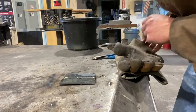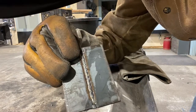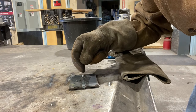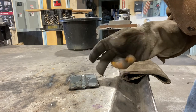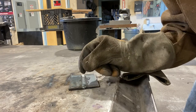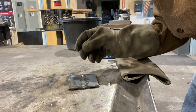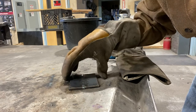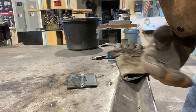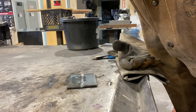All right, when all is said and done, you're going to find a pretty flat-looking weld, but also you're noticing the penetration that's on the other side of that weld. What you're looking to do is create a nice consistent spacing — keep inching further and further. Something you could definitely notice with my weld here: maybe I went a little bit too far with each time I was moving forward. You don't want to go too far and create an inclusion or some sort of pore within that metal. You want to make sure you're keeping your weld nice and close together. The big deal is that you're creating a nice, even, consistent arc through that weld and allowing that weld to really sink into the two pieces of metal and gain penetration.